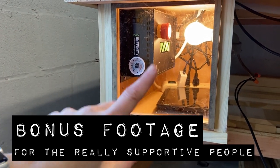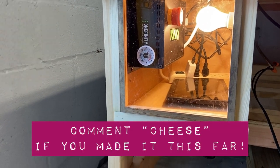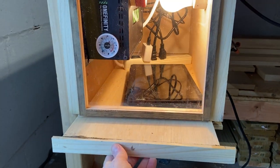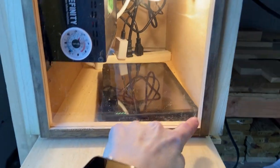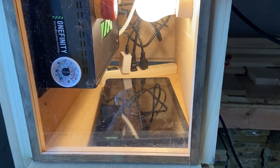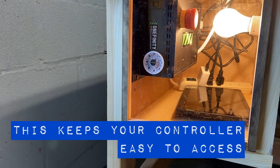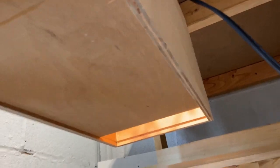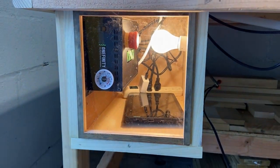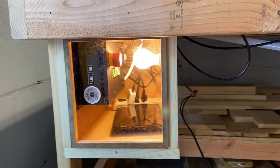If you do build a box like this, to make it easier to access all those cables, make the bottom panel removable — floating, basically. I ran a groove through all the sides on my table saw and did not glue the bottom panel in. So anytime I need to access the back of that control box without unscrewing anything, I can just remove this panel from beneath as far as I need to and reach up in there to get access to the wiring. That's pretty important. And that's my box.